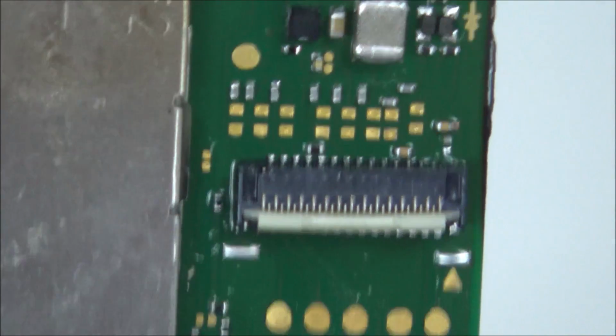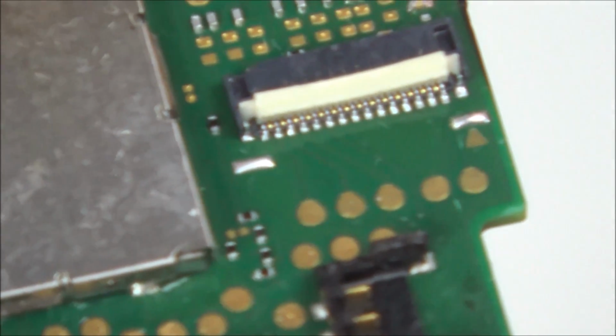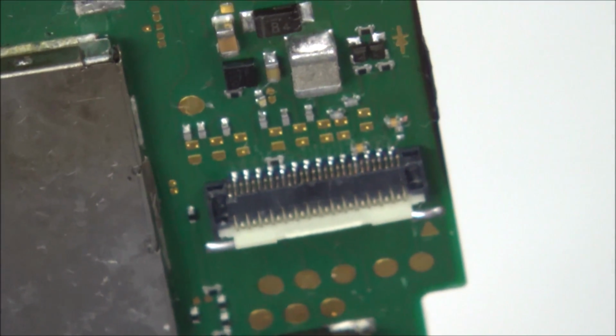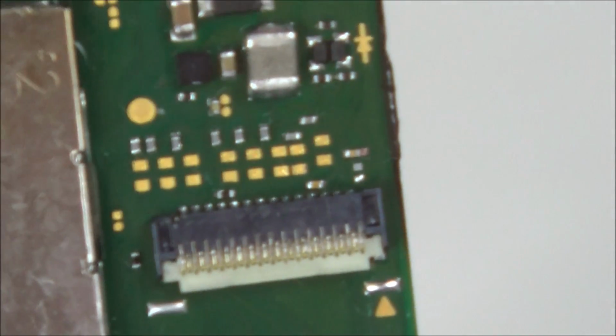It's all cleaned up now, and I've actually looked through my microscope, and it doesn't look too bad. So you can see all the pins there. That side is good. This side isn't so good. You can see it goes off, up, higher on this side here. But all the pins do look to be soldered, and they are on the pads, so I think it might be okay. And if I close it, the lid does look like it's working.